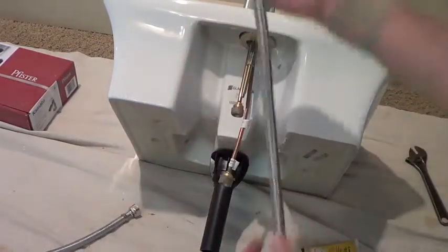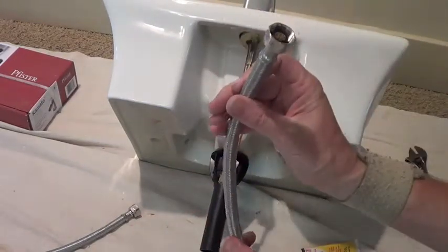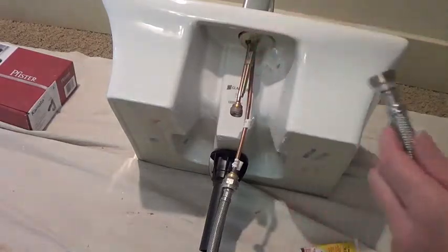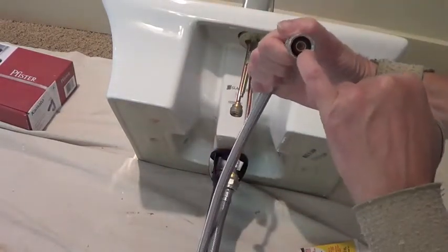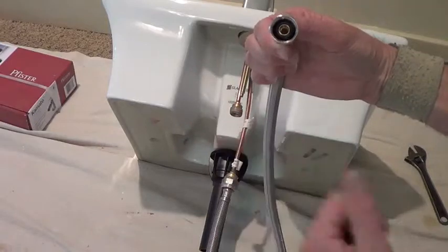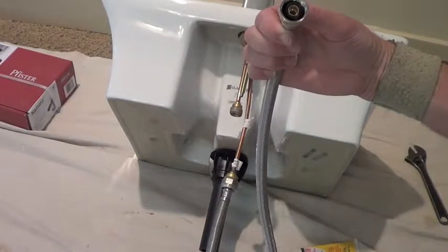I really like to use stainless steel hoses — I don't trust the $1.99 plastic variety. You don't want to over-tighten these either, because they have a rubber washer inside, same as a toilet supply line. You can't over-tighten past half a turn past contact, because what will happen is it will destroy that rubber gasket in there.